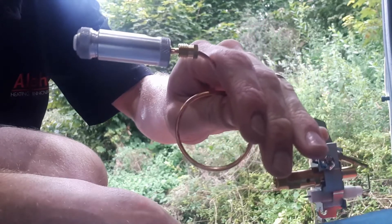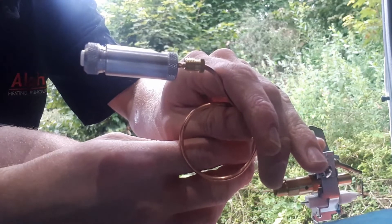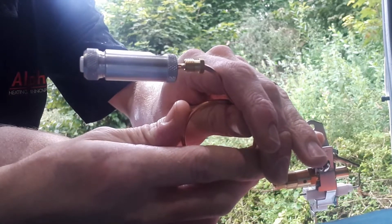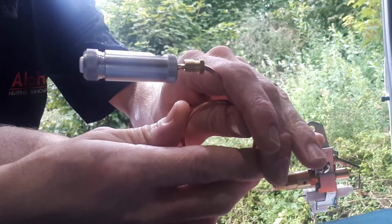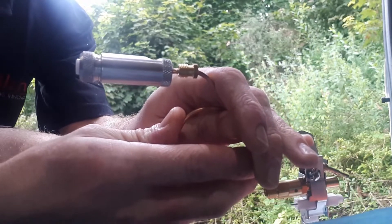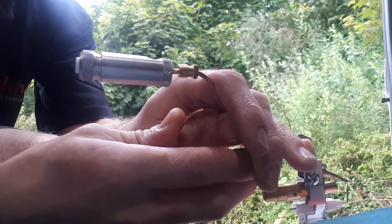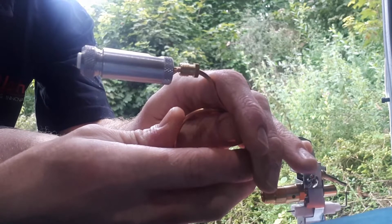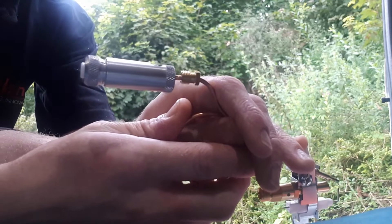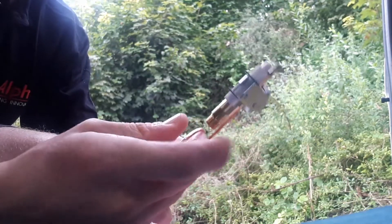This one's holding, so the thermocouple is good. It'll hold until it's cooled down and then releases - that's going to take probably about 60 seconds or so. Out she pops - test complete.